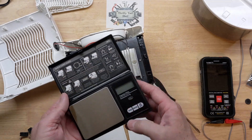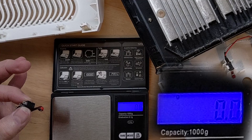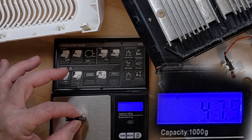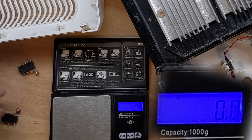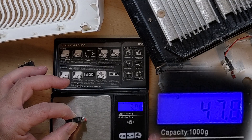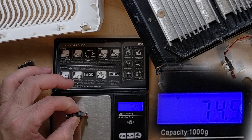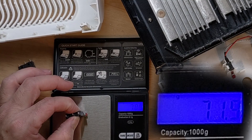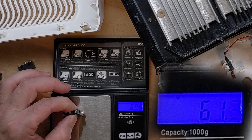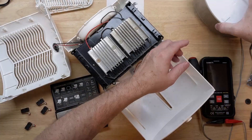I'm going to use this small digital scale to show you — you've got to be careful when you buy a lot of these. If we check the pressure it takes to trigger them, this one's actually pretty good: right at or below 50 grams, and the roller triggers it right at 50 grams. This other one is a little harder to press — let me show you: it's over 84 grams, almost 90 grams. And this third one is right at 78-80 grams. So that does matter, especially on the float switch.